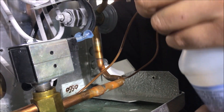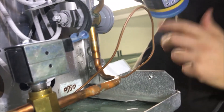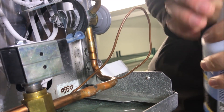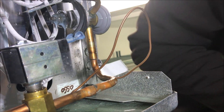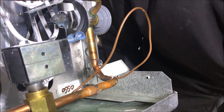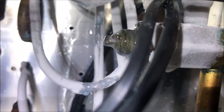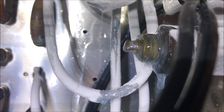Let's spray this up with our Big Blue here — Big Blue bubbles. Let's see if we can pinpoint where this leak is at. I always want to see the bubbles, and I always take a picture of the bubbles — I always attach that to the work order — just to be 100% sure. The customer's not going to question it, but once they see a picture of the bubble they know for sure it's leaking. You can see right there at 12 o'clock we got a little bubble growing there — definitely pinpointed the location of the leak.